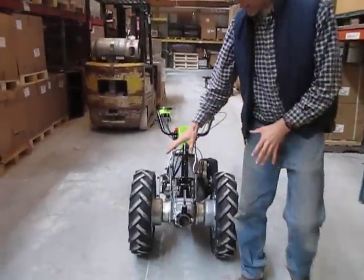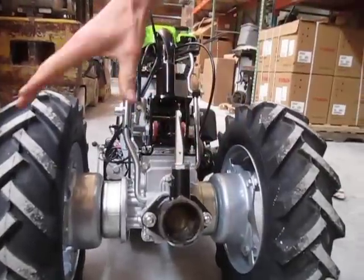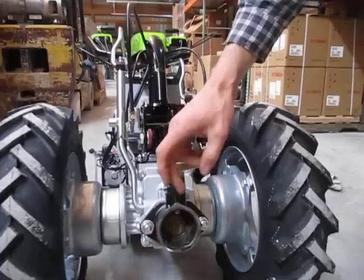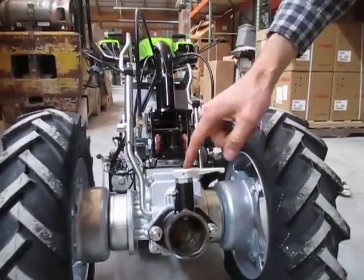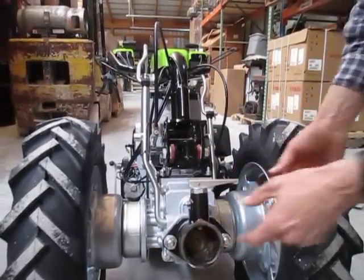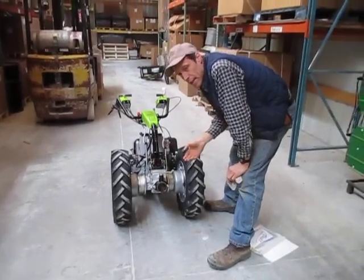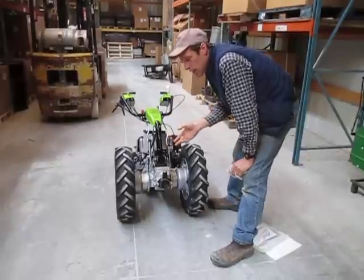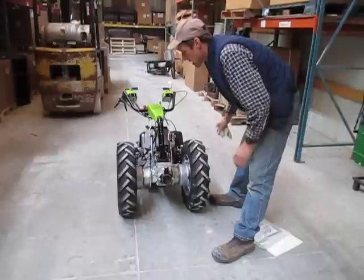Your implement is going to plug on here at the quick coupling. This is the locking pin that drops down to lock your quick coupling in place. Once you insert the implement, just drop that down and it snaps into place. Make sure this drops fully — if the pin is not quite lined up with the little hole it needs to line up with in the implement male that goes in here, it's not going to lock down and you'll lose your implement. We have videos on our website specific for using and maintaining the quick coupling system. They all reference a BCS tractor, but the quick coupling system works exactly the same on the Grillo.